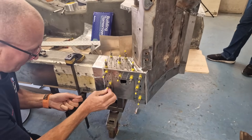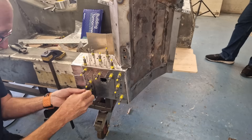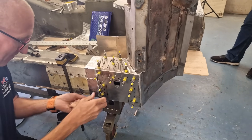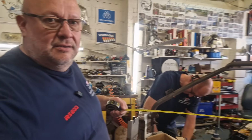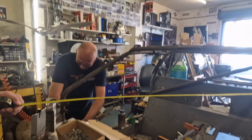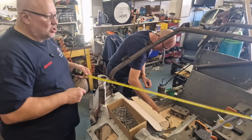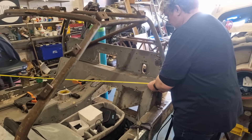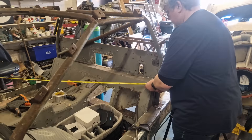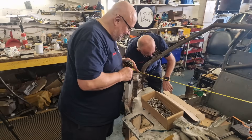The worry is the front of that sill isn't perfect and the bit that's onto it isn't perfect - it's okay now, but when you put a load of rivets in, stuff moves. We're okay so far. Just onto the corner there, Gordon - pick a corner, any corner. I want to check my diagonals because when the rivets start to go in, I want to make sure nothing bad happens. We're same side for side at this point - no tension on anything. We seem to be okay.